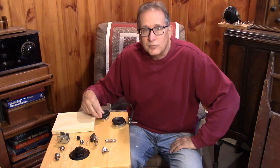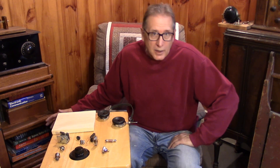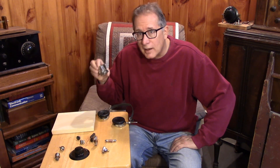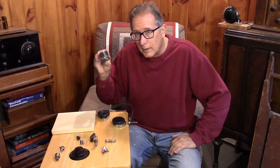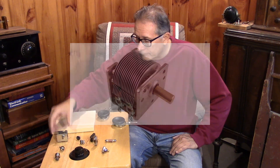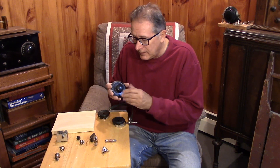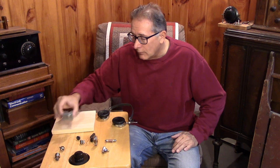The next question people ask is how much is this going to cost. A lot of projects take specialty items that add up to over a hundred dollars, so I tried to keep this as simple as possible. You will need a 365 picofarad variable capacitor of some kind — available online or from radio parts stores — for tuning the AM band receiver. Rather than an expensive vernier, we're just going to use a large dial that gives mechanical advantage and lets you tune stations critically.